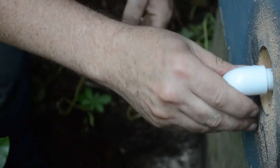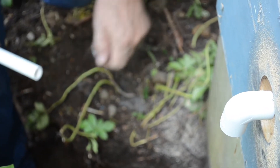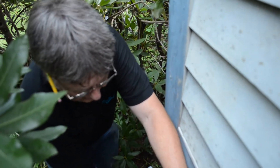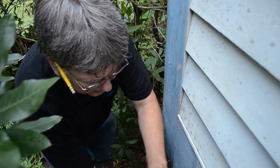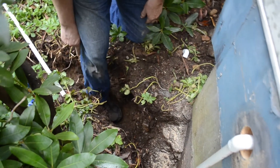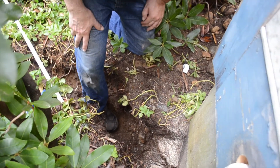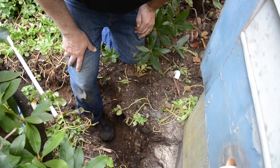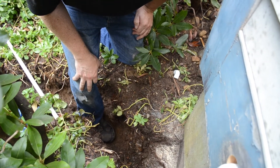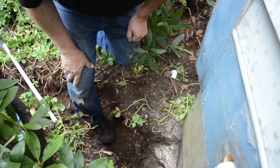I'm dropping down about three feet from where I pass through the wall, and now I'm going to follow the bottom of the trench. My trench comes over and then I have a 45-degree angle before I can go straight, then make another 45-degree angle into the riser to the genie. A lot of times, hopefully you're not having to go around bushes and things like that, so you'll have a straight shot from wherever you mount your pump to where the riser is.